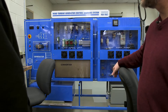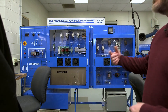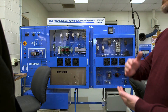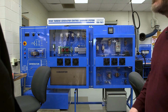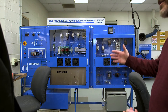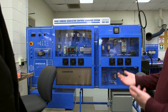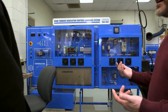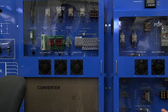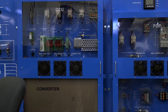This is the generator. When this starts up, you want to get it going fast enough to generate electricity. When it hits that speed, it closes the contactor to bring it online and start generating. Depending on how fast it goes determines how much electricity is produced — you're not generating full power all the time. At 8 meters per second you might produce half the power, but at rated power around 12 meters per second you generate peak power until you hit 25 meters per second, then you shut off because it's too fast.